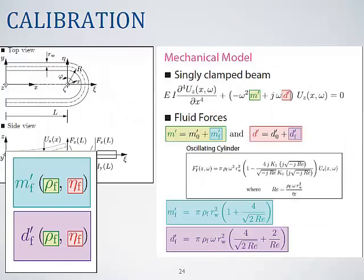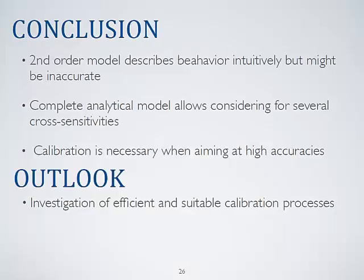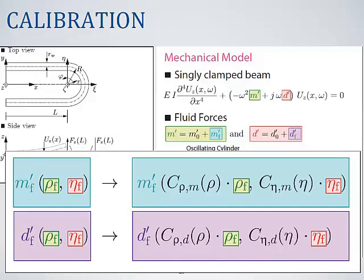And now I unfortunately do not have a good message, but two bad ones. As I mentioned before, viscosity and mass density affect both the inertial term and the dissipative term. It means in the worst case, you need 4 calibration quantities, and as the function fails, you do not need 4 factors, you need 4 calibration functions. So in your model, you introduce empirical calibration functions, and with these empirical calibration functions, you will be able to fit your model to the measurement.